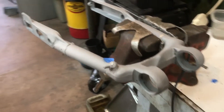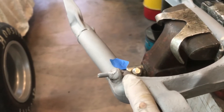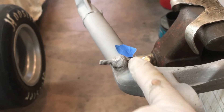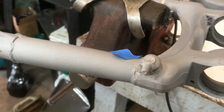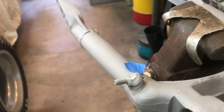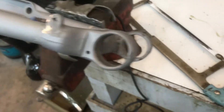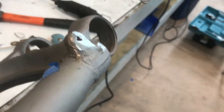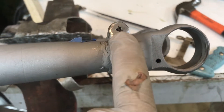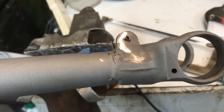The best way to approach this repair is to go ahead and hacksaw the actual bolt off, and then see if we can expose the back side of this drill bit. If we can punch it back through this way to blow it out of the hole, then we can go ahead and weld that up and make the repair. So I'm going to go ahead and hacksaw this bolt off now and see what we have after the fact. I went ahead and cut off the little bolt, took the grinder and ground it down to the proper shape, and there is the hole exposing the back side of that drill bit. So I'm going to go ahead and take a punch and try punching it through to see if we can knock that drill bit out. If not, I'll reverse it and try it in the other direction.